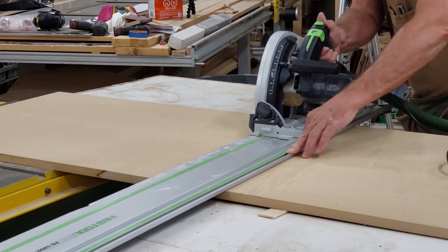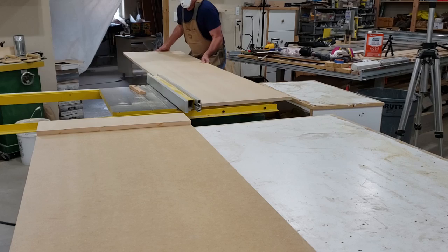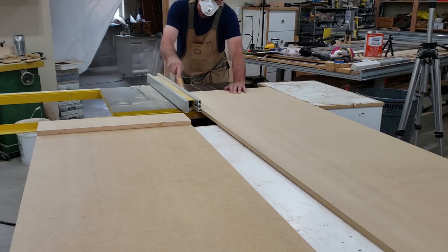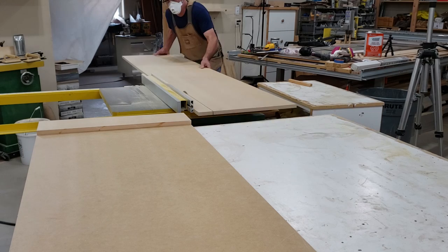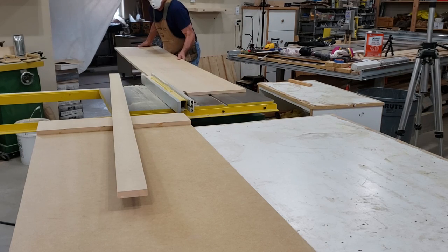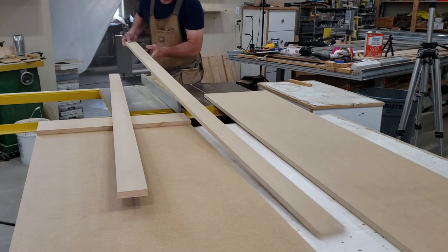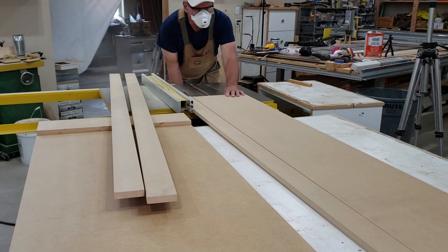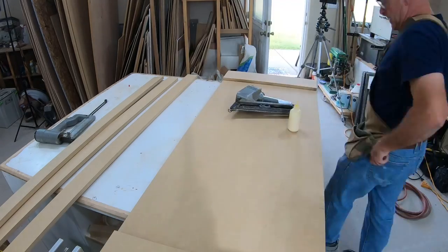I will add another video about the full build of his desk, but let's take a look at how the top is built and how we can install black plastic laminate on a 66 by 30 inch piece of particle board to give us a real solid and functional desktop. Particle board is what I like to use as the material to apply laminate to if at all possible. It is very heavy to work with, but it's also quite inexpensive relative to other products and is a great surface to apply the adhesive that we use for sticking laminate.